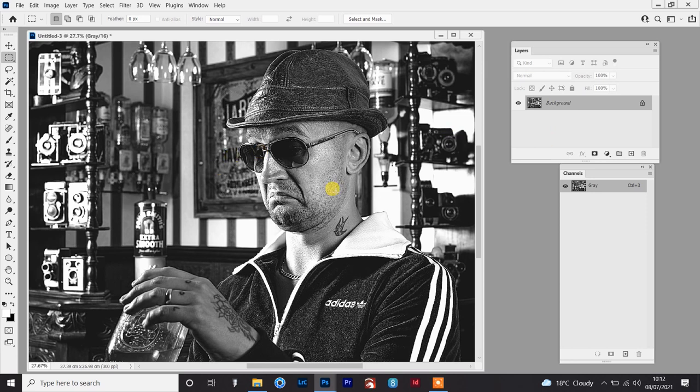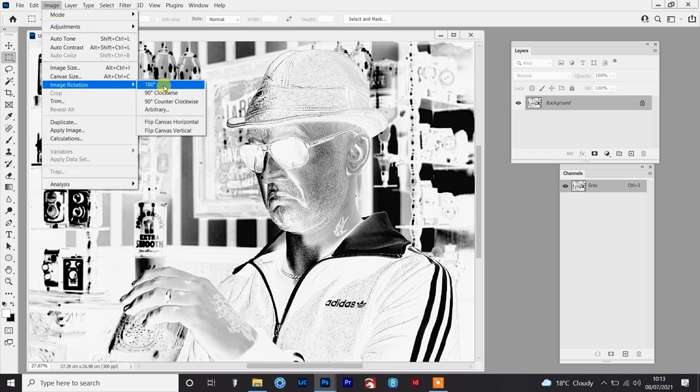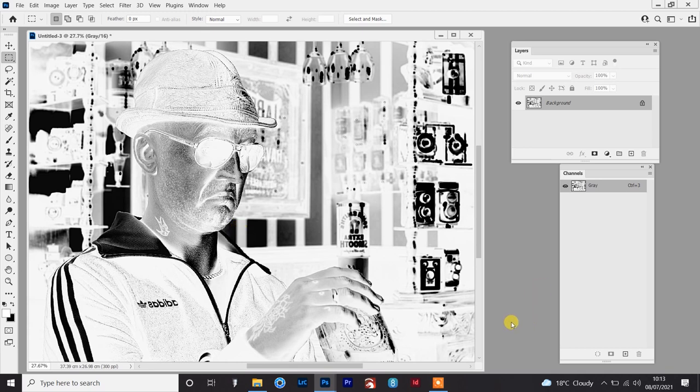There are just two more important steps. The laser works like a printer — it prints black ink fading to nothing in white areas — but when the laser etches the surface it's not going to etch black, it's going to etch white. So we need to invert this image with Ctrl+I. Now anything that's black will be etched by the laser and hence come out white on the glass. The only other thing: because I'm doing this on the back of the glass, I need to flip it so it's mirrored — Image > Image Rotation > Flip Canvas Horizontal. Then I'll save that as a JPEG and drag it into the laser software.